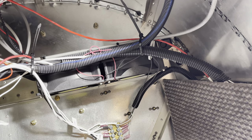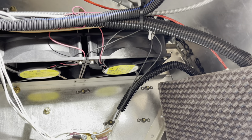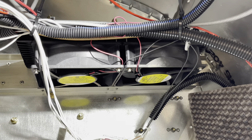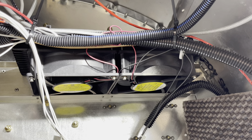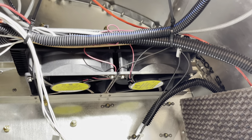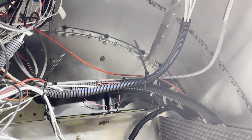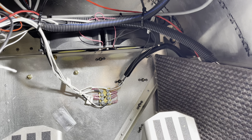You're probably going to need some kind of heater in your airplane. Viking sells a heater — you can get ours or a different one, but they're all based on fans and a heater core, just like in a car. We're covering this now because the hoses from the engine are what we're working on. Our instructions show to put the heater nipples through the firewall — we don't want to run hoses inside the airplane, so the hot coolant stays in the engine compartment only. Once the heater is physically mounted inside the airplane, in this case above the rudder pedals with a single and dual fan, that part is done and we'll work on the rest outside in the engine compartment.